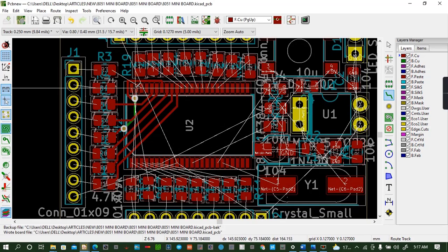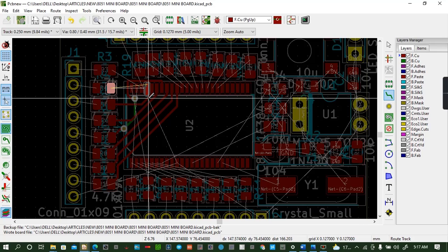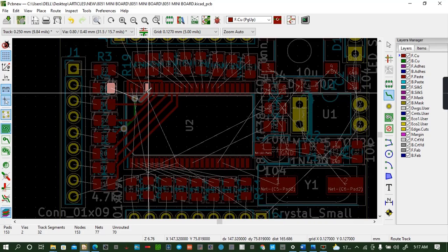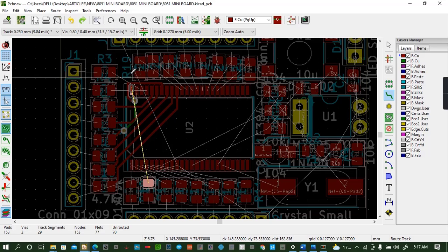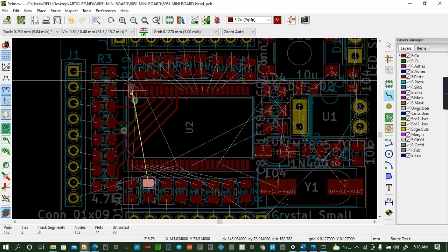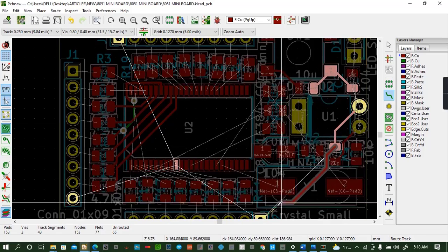You can see, I've gone to the below board like that, and I have routed it. So you go to the next part, again a via. Wherever a via can be placed, you place it there. So again, this one, you place over here. And so on until you get the right thing. So you route the first to be routed. Anything that is possible to be routed, you route very quickly. You start with the simplest ones to create over here as routes.